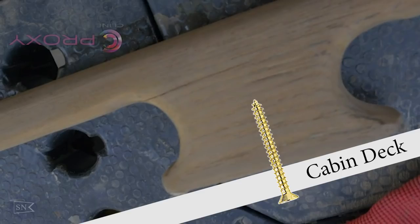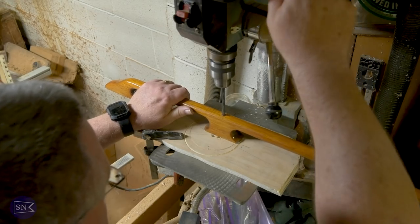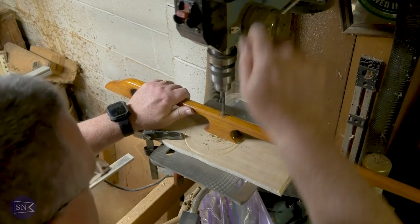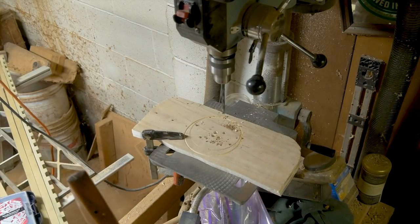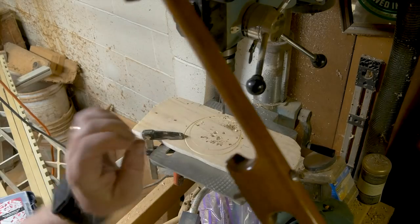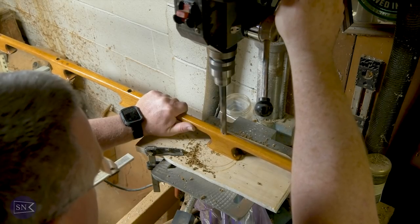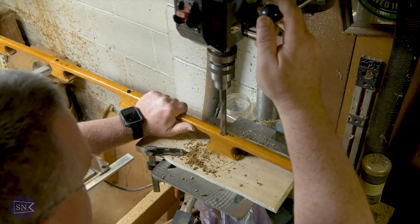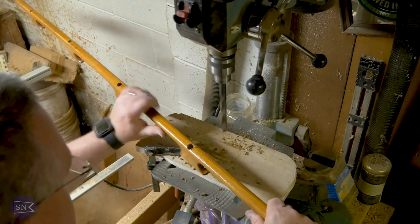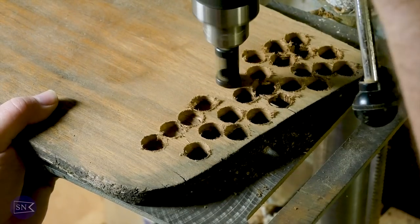So I decided first to replace the anchoring points from being inside the wood handrail sides and instead use a through bolt from inside the handrail and place a nut on the bottom to really make it solid. To do that, I drilled holes carefully for the width of the shaft of the stainless steel bolt through each connection point on the handrail. Then I drilled out another hole a little wider halfway down to accommodate the head of the bolt — this contact point for the bolt would make a very strong anchor point. The diameter of the larger bolt hole is identical to the plug cutter bit I used to cut out some teak plugs to fill in the holes and make it all watertight.